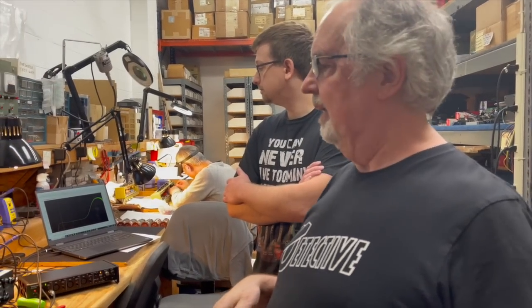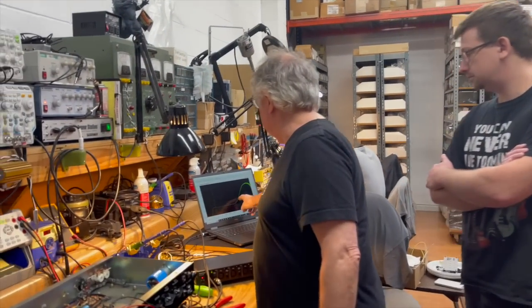This is why, like on a Marshall, that sort of natural feedback happens in the up mids to upper mids, whereas in a Hiwatt you just hear this really broad brushstroke of feedback, and it isn't very specific. It's because a lot of it is happening up above the hearing range, where you don't hear it.